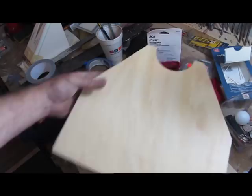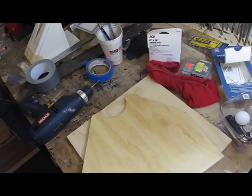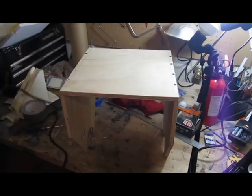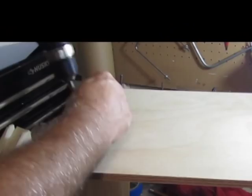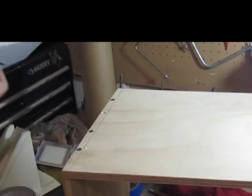Here's the yoke — it's just three pieces of plywood. Put them in this way because it's weight-bearing; you put them down onto that base plate, you don't screw them to the sides. You screw them down — that's how it will bear the weight. Same thing applies: drill the pilot holes and set screws in there. You should countersink these holes — countersinking lets the screw sit flush below the surface of the wood. That's important because as you rotate it, button head screws that stick out could rub on the cabinet and prevent rotation. Use flat head screws — they sit flush with the wood.